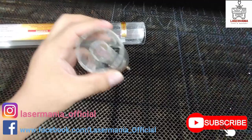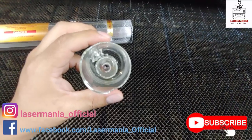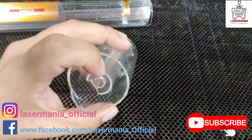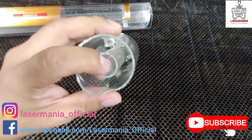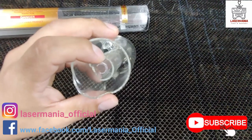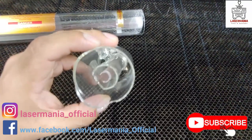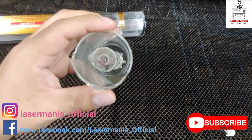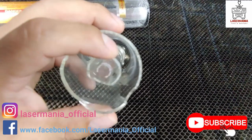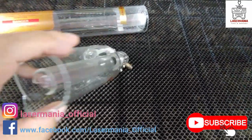We can clearly see three layers. The first layer — the outer layer — just contains everything, like a container for the whole thing. The second layer, between the outer and the inner tube, is where the water passes through, continuously refrigerating the beam. The beam itself travels across the inner tube, the smaller one. The third one, the innermost, is where the beam passes through and where the CO2 gas is located.